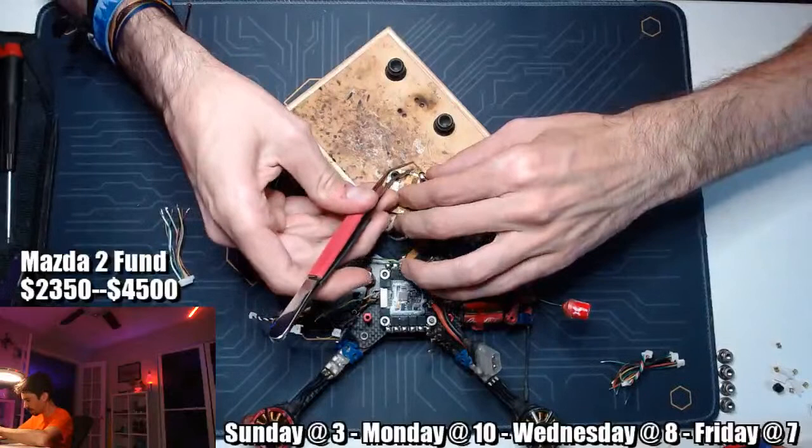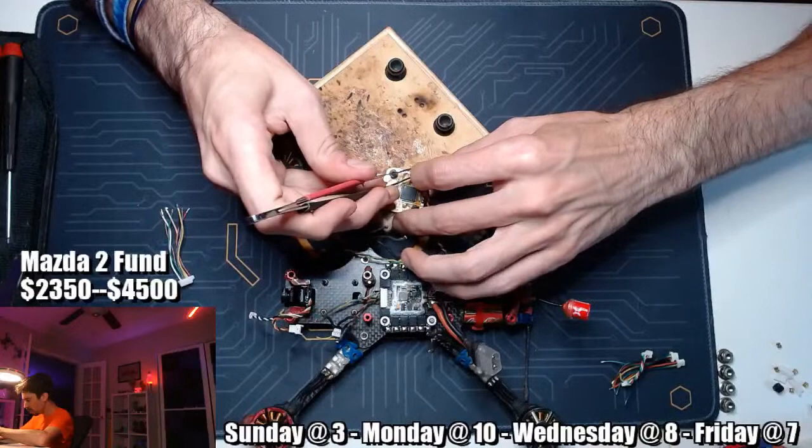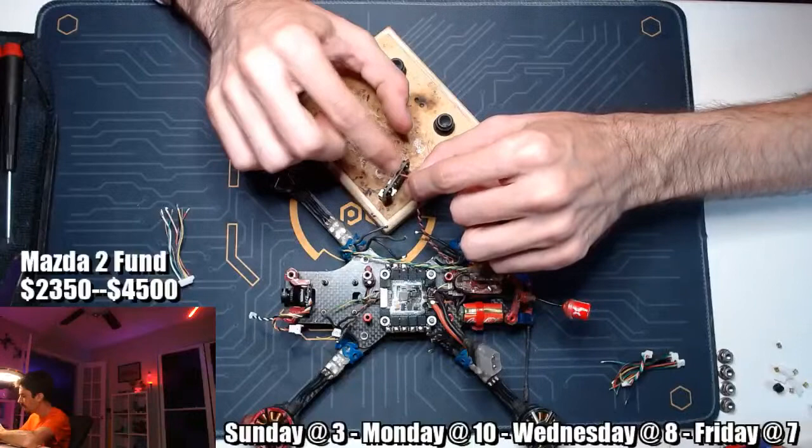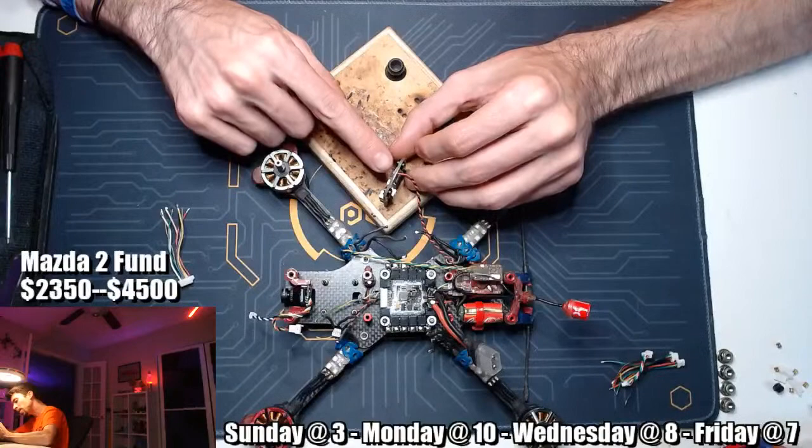So here's how I like to use these through holes. I try to put 2 wires through at the same time, dry, and then I'll stand the flight controller up like this so that I can control how I want the wires to be all the way through there. And then you can just look at the bottom of the through hole and you can see them peeking through, right?